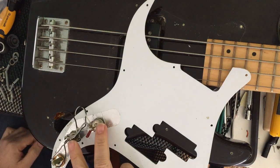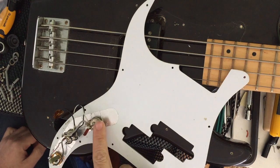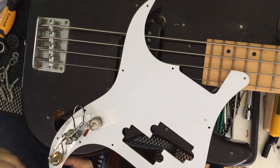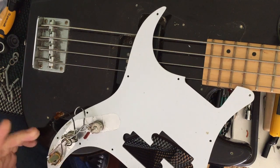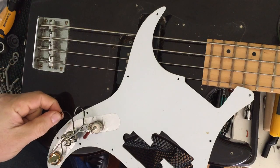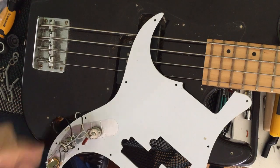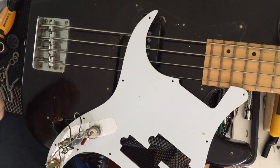The pots are wired around the wrong way. This is the volume pot, this is the tone pot — but this should be the volume pot and this should be the tone pot. The output jack is a flimsy plastic piece of garbage. Essentially what we're going to do is fix this. I'm going to put some heat shrink on there instead and re-solder this the other way around, obviously.